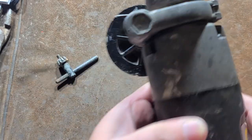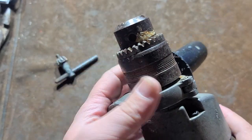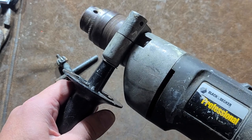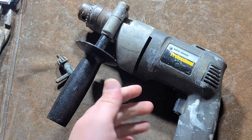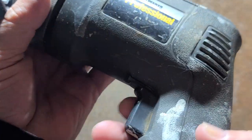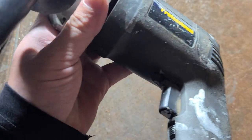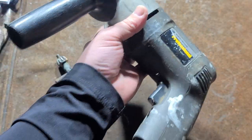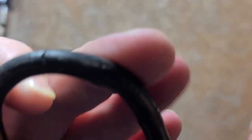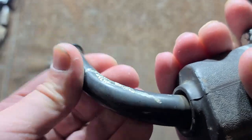Overall it's not a bad drill — the spindle is nice and tight, no end play, no side-to-side play. The chuck does have a lock screw in it. It was an adequate drill, just not my favorite. This is also the era of the world's smallest reverse levers — a little matchstick. Variable speed is pretty smooth and very linear, which I did like, and of course there's a spindle lock, which has been disappearing on more modern tools. The power cord hasn't held up great — I ended up swapping it out — but surprisingly the strain relief has held up just fine.